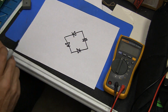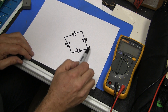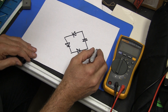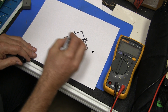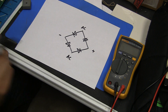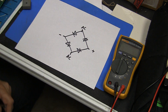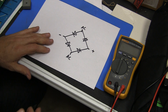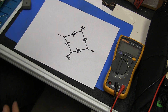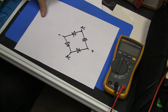This indicates that current can flow in one direction but cannot flow in the other. The diode basically blocks the current from flowing in the opposite direction. You have a minus and a plus side, and then you have your AC connected on these. So you hook the AC into here and your DC comes out here. Depending on how much power is flowing through it, these things can get hot and you may see heat sinks on them.